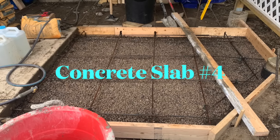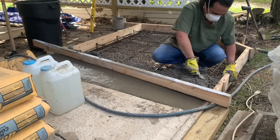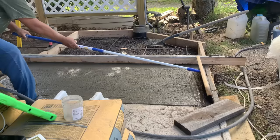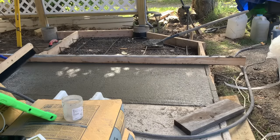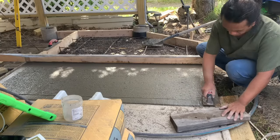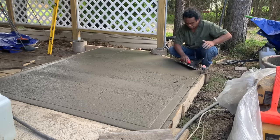On to slab number four. On the lower right side there's a little indent where the driveway ends meeting up to the carport. With my trowel I'm compressing the concrete around the rebar along the whole way. The problem was that half of the slab started to set, so I needed to work on it right away. I edged and broomed and then edged again. With one bag left to go it's the same process as before.